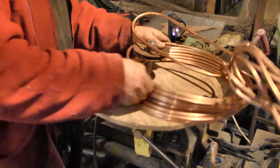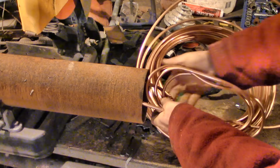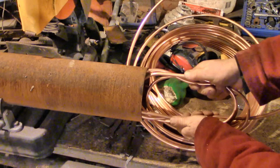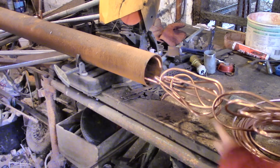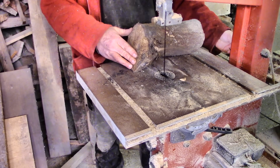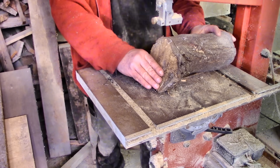Because you can't store any of this steam, it is released as you make it — so it's either used or wasted. If your fire cools, you won't have any reserves of steam and your engine will slow down or stop. That's why train locomotives and traction engines have conventional pressure boilers — they want a constant reliable rate of steam. But flash steam boilers have been used to run engines in the past, and perhaps they could again.